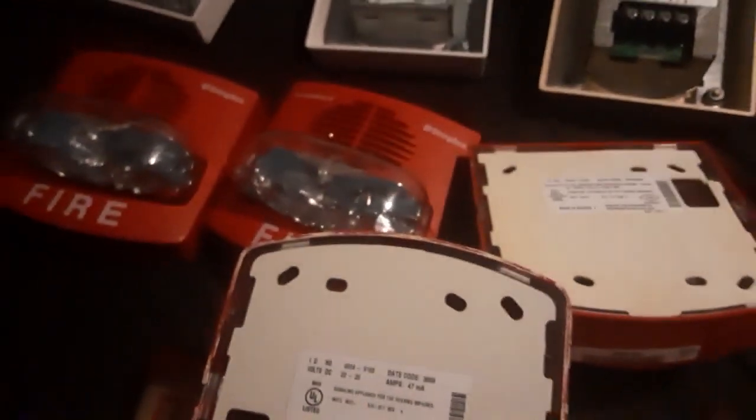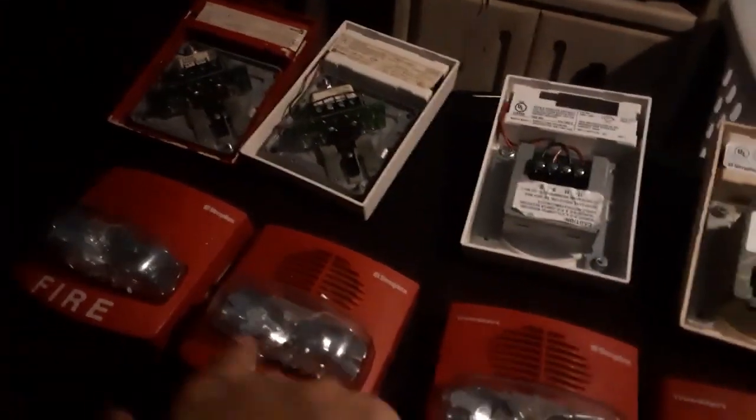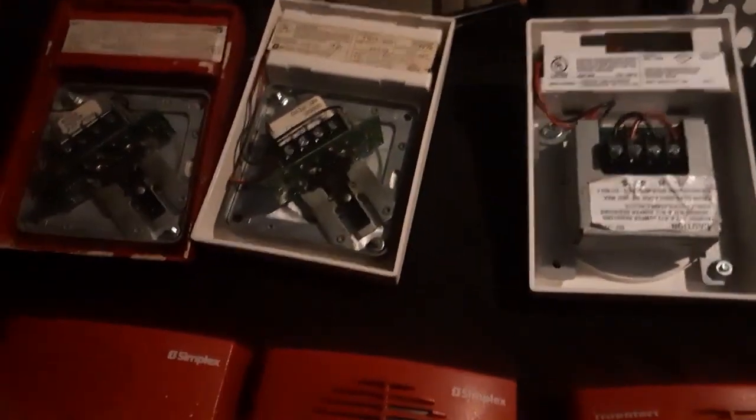If that doesn't help at all, I will put a link in the description for a model search, but don't guarantee it'll show you everything. On the older 4903 side, I really don't have to worry too much other than the 120-volt AC model. For the newer versions, look closely between the old part and the newer part. You have to look very, very close to the model number. Stay away from the 4906 and I think the 4905 as well. Also, if you see a ceiling version of these, stay away from it. The same applies to the remote strobe version — just watch out for those kinds of holes. If it's a ceiling model, make sure it's the old version and not the new one where the font is a little thicker and smaller.